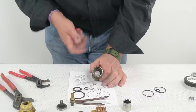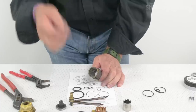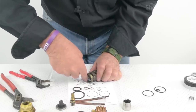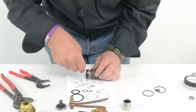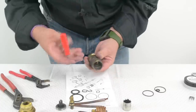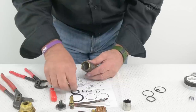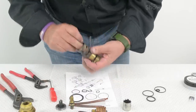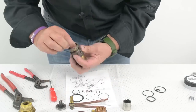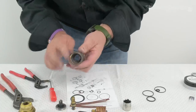But now's the difficult one — this O-ring in here. This can be difficult both to get in and to get out. If you use something like this, probably the best plan is to just stab the old O-ring with something sharp. You won't be able to see this because it's so encased and enclosed in here. I've just stabbed it and I should be able to pull it out now. That's out of the groove. There we go — so that's the old one out. It can be equally difficult to get the new one back in, but you'll have to bear with me as it's a bit of a fiddle. I managed to get that in there — I'm quite happy about that.